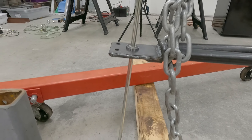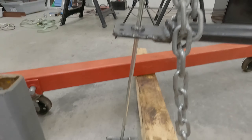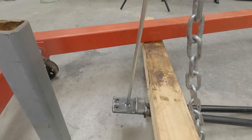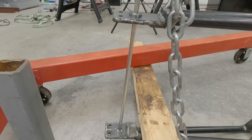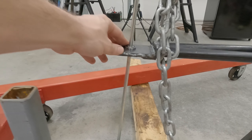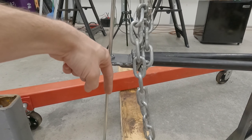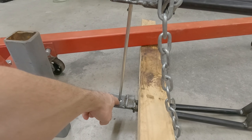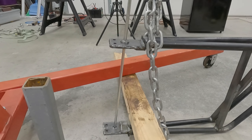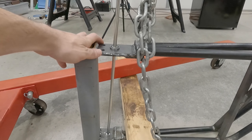The other problem with using a torch is these bearings — last time I built one of these I didn't realize how close the tolerances are. It actually took quite a bit; I had to hammer this in to get it just right. I'm also hoping that heating this up and letting it cool down will get those back into alignment so I can slide this tube in and out a lot easier. It has to slide in easy without resistance, because any resistance at all will make it impossible to add or remove in the field. The axle is hollow — it only has enough room for this tube — so if there's too much friction I won't be able to get it through. I had all this stuff perfect until I welded that x-brace in. What I probably should have done was already had something like this wedged in there and tacked it so it wouldn't bend.